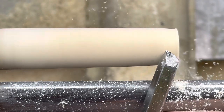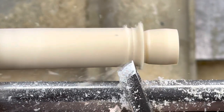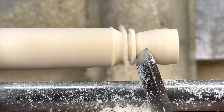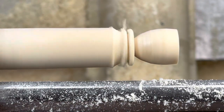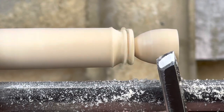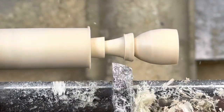Readjusted the tool rest and starting to shape the bowl portion of the goblet, making a series of cuts — mostly planing cuts. The short point gets into the end grain, so I back it up and nibble away. Reshaping the very top portion of the bowl, nibbling at the end grain again, then some peeling cuts to give myself some room.